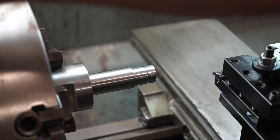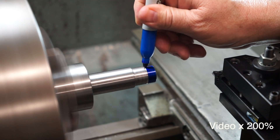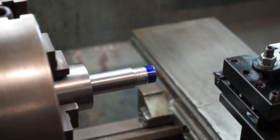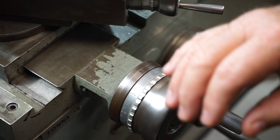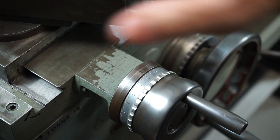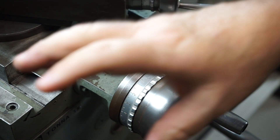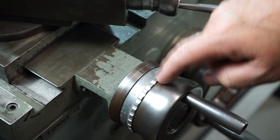We're going to paint this surface and do our test cut to ensure the correct pitch has been selected. When threading today using the angular approach method I won't be using the cross feed. I've got the cross feed dial set to zero. Since my lathe is imperial and I'm cutting a metric thread, I'm not going to disengage the half nut — I'll leave it engaged, back off, and rewind. Otherwise you risk losing your position and stuffing up the thread.